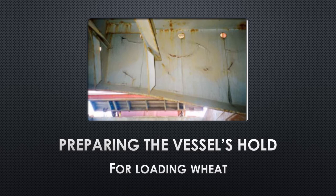Recently, many surveyors have been asking students about preparing the vessel specifically for loading a grain cargo like wheat, which is why this video was made. You have to understand that grain cargoes are hygroscopic products — they have a natural moisture content within them. During a voyage, due to compaction, vibration, and vessel movement, this moisture content may come up on the surface of the cargo and create problems, which is why surveyors want mariners to be fully knowledgeable about the properties of such cargo.